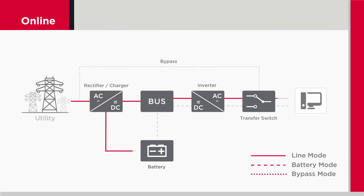The third and last is called online or double conversion. The UPS converts incoming AC power to DC and then back to AC while charging its internal battery, providing the ideal output power. When the utility power fails, it switches to battery mode to keep loads operating. The bus supplies buffer energy to prevent total energy drop during switch operation, which results in zero transfer time. When the quality of utility power is good, the UPS switches to bypass to increase system efficiency. Commonly used to protect critical applications such as data center equipment, communication hubs, and other industrial applications.